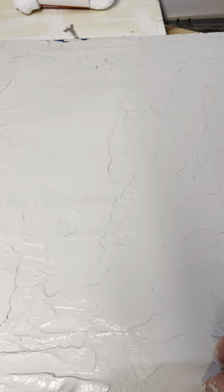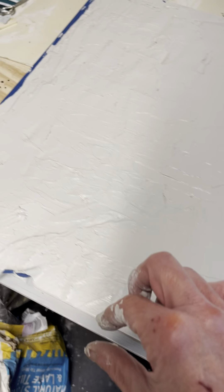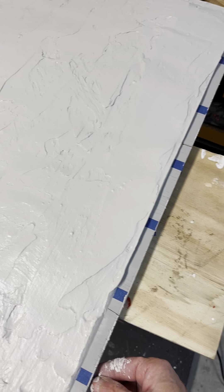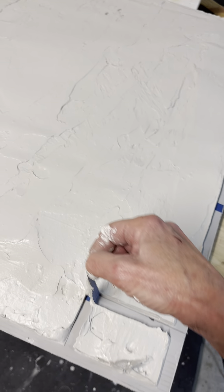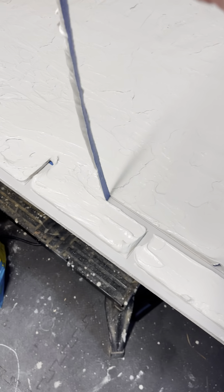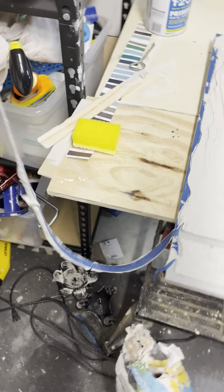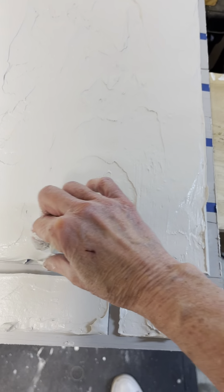So I'll start to see the bricks here in a minute. I kind of put the mud on pretty thick, because it's actually going to be the back of a faux fireplace. So I wanted them to be pretty visible. Up on a wall, it doesn't matter quite as much. I kind of give it some texture as I'm putting on the drywall mud. They are kind of different thicknesses, and they have little mars and imperfections, like real bricks would.